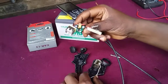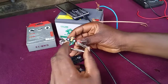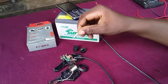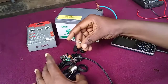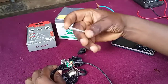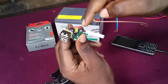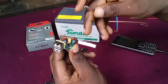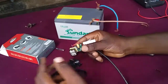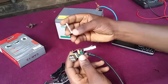When someone tells you how to repair a certain electronic device, there are a lot of things that can be broken — there is no single solution on how to repair a phone car charger. What really pains me is that from this phone charger you can see the fuse is perfectly fine, it is not blown up. So what is the purpose of this fuse if it allows the IC to get so hot and blow up? I bought this brand new from the shop, plugged it onto my battery, and immediately saw smoke. I thought it was the fuse that blew up, but it was not.